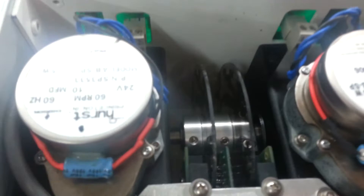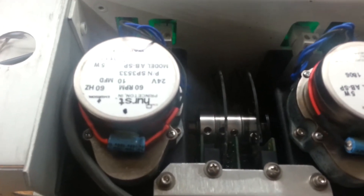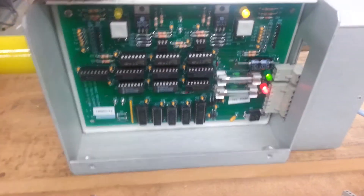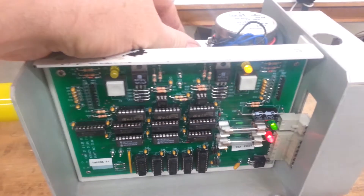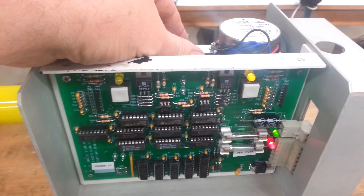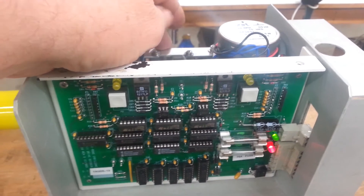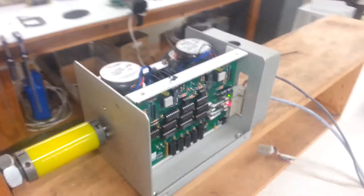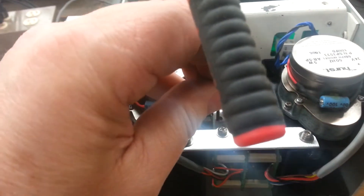I can't do this with two hands, so I'm going to pause this and do the adjustment. So the minute hand is lined up and we're adjusting the wheel — we're going to go to approximately the middle of the location where the light turns off, because there's a little bit of play and it will stop the motors approximately in that position. Then we just tighten up — just snugly — we don't want it real tight.